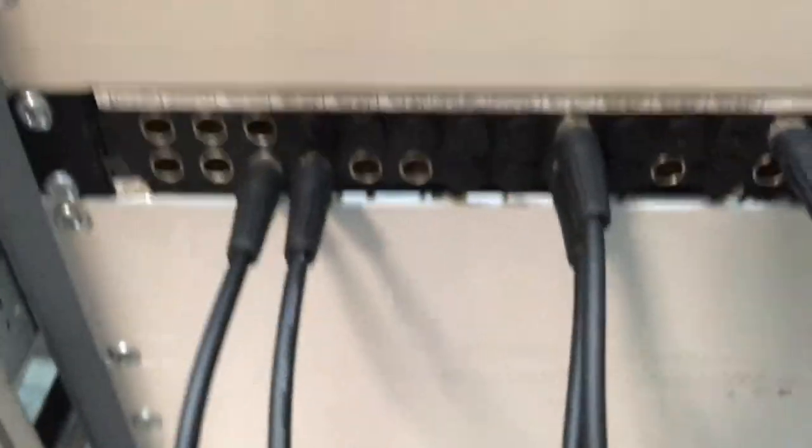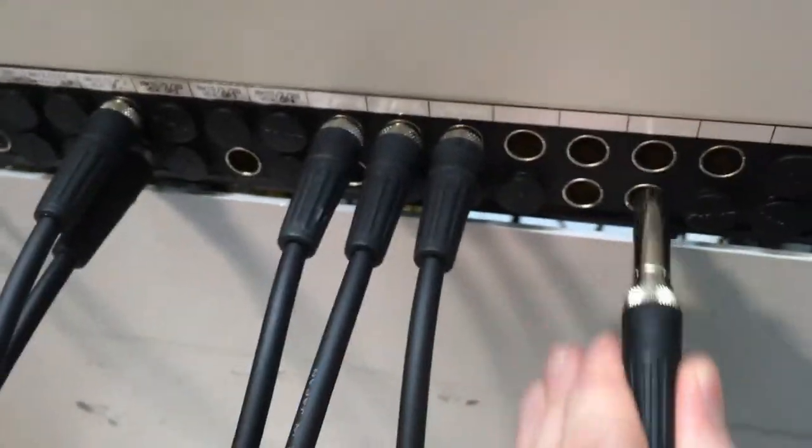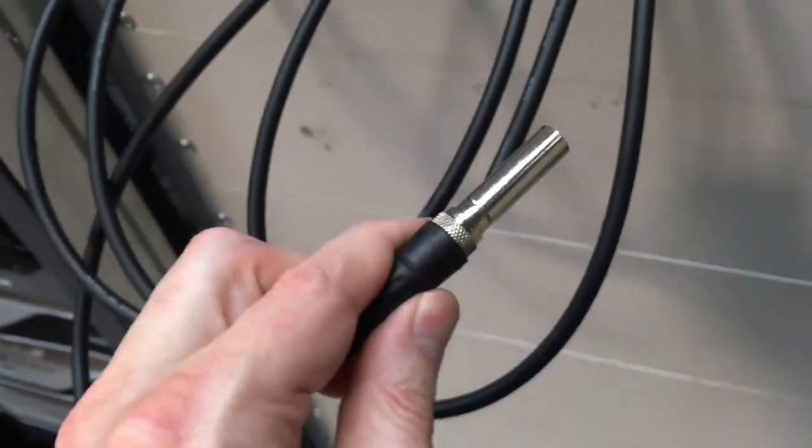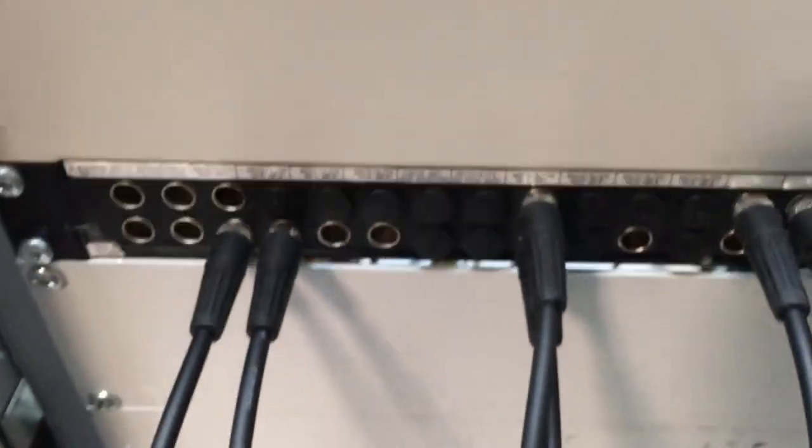You'll also see up here we've got some set-top boxes which are working via HDMI. Once again, like on the camera, we've got the Blackmagic converter to convert them from HDMI into SDI. Here's a couple of patch connections in action - that's what these plugs look like, they just patch straight in. Once again, SDI is like audio - you can quite easily divert it and patch as required.